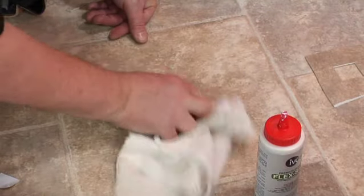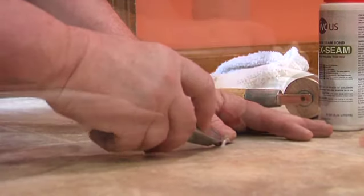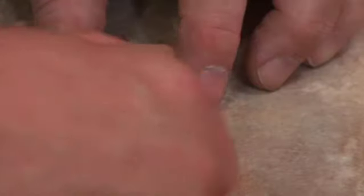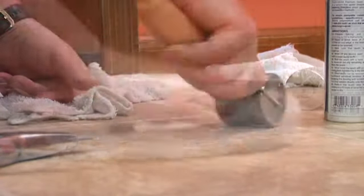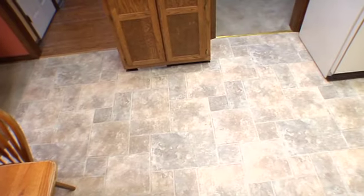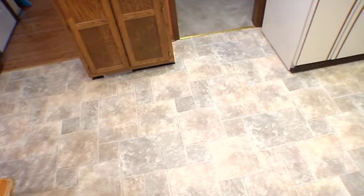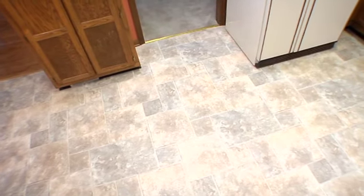The finished repair should look as good as the seams. To repair a gouge, simply heat the gouge so it will lay flat. Lift the edge and apply seam sealer. Carefully work the edges together, then roll the seam firmly with a hand roller and wipe off the seam with a clean damp cloth followed by a clean dry cloth. Improper installation or seasonal movement of walls and subfloor can cause a need for repairs. Most items are easily corrected by identifying the cause of the bubble, wrinkle, or crease and taking the appropriate corrective action.